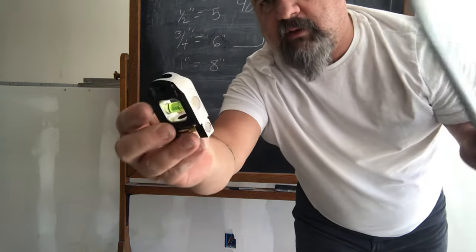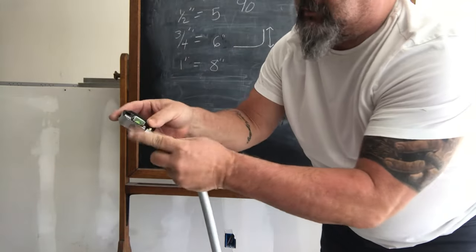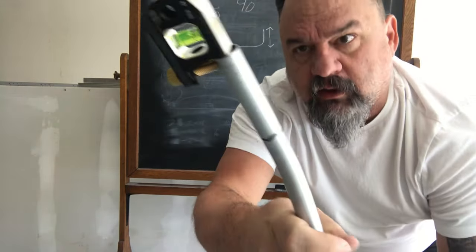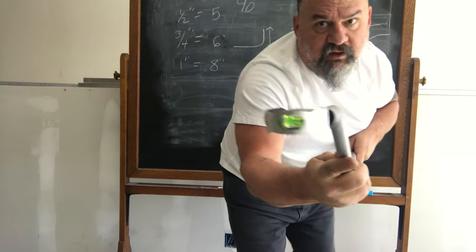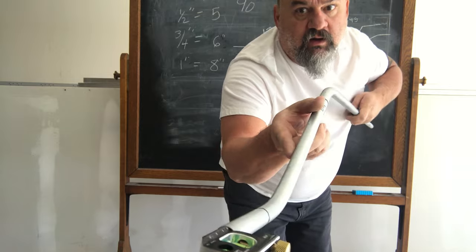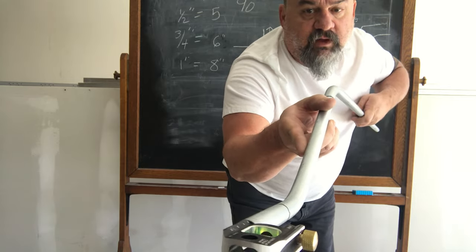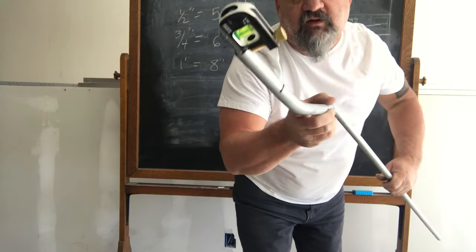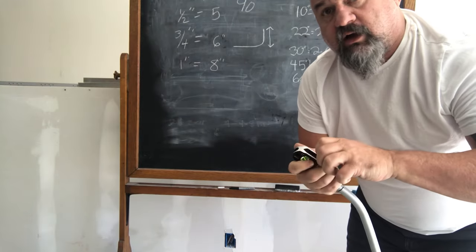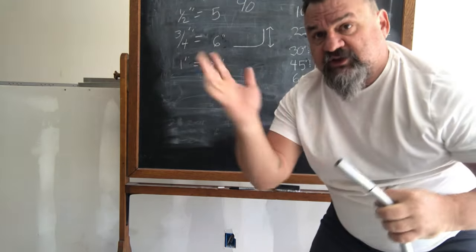There's a little tool called a 'no-dog' in the trade. You put it on your first bend — it's got a bubble level on it. You put it on your first bend, start bending, and when you flip the pipe over for the second bend you make sure the bubble is centered. That ensures the two bends stay in the same plane. Great little tool.